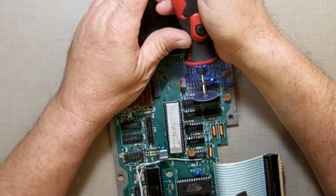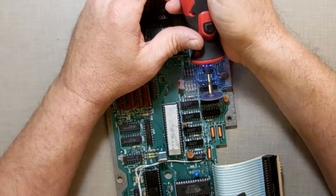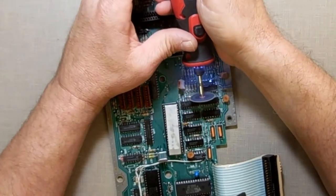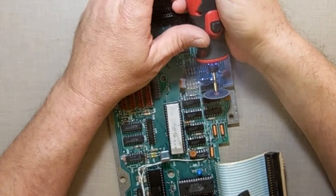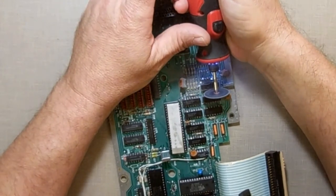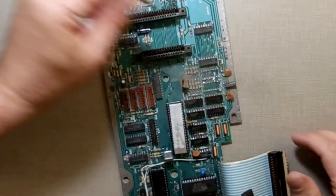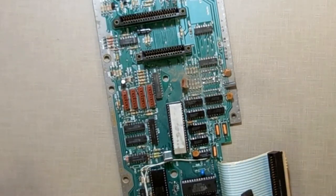I'm not putting any pressure on it. And there we go — move the chip out. See how I cleaned it right up, nice and clean. The legs are still there, didn't touch the trace. I've just got to do six more just like it.